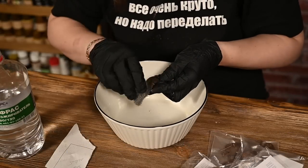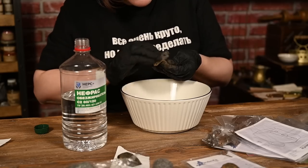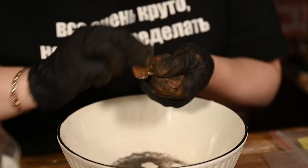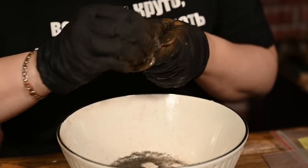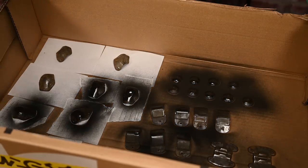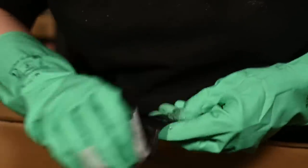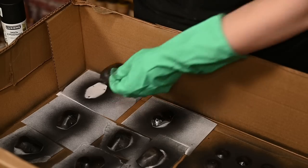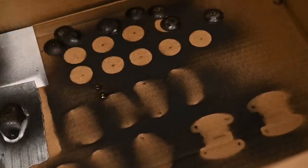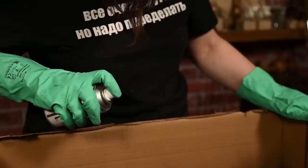The hardware is quite rusty so before returning it to place I want to clean it. I'm removing the rust with gasoline and steel wool, and in the most damaged areas I'm also sanding it with fine grit. I'm spraying the hardware lightly with black paint and then wiping the paint off in some places using a solvent. It turned out very natural looking and at the same time I sealed all the remaining rust. I've decided to replace the nails, and since our local hardware store had only antique bronze colored nails in stock, I've also tinted them black.